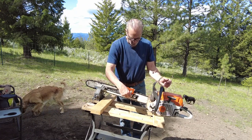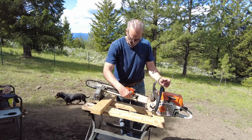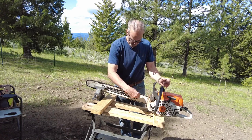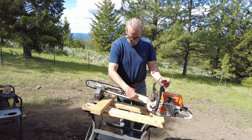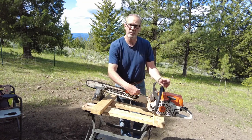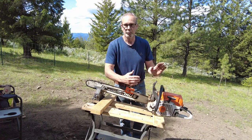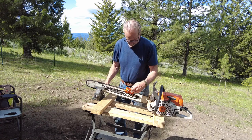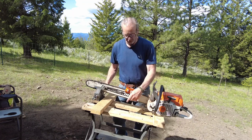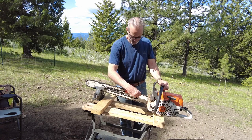It's not optimum. Optimum would be to have a couple of years letting them sit somewhere in the shade but dry so they could cure and be less likely to crack, because if they're out in the sun, they're going to probably crack because they'll dry too fast. But a good slow dry would be optimum. But I'm going to put it up green on this cabin, and this winter I'm going to cut down stuff for the next cabin, which will still basically be green because by the time I start building the next cabin, which will butt up to this first cabin, the wood will still be green and it'll still shrink and possibly get cracks in it, but I think it'll give it character. I'm not too concerned about it.